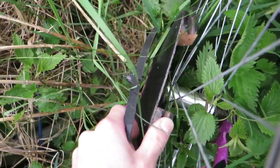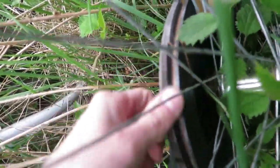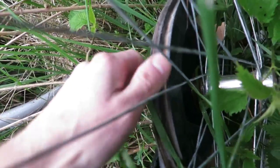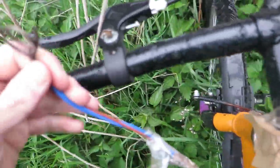Motor shell and the pulley were made of hardwood. This is probably a reason why the motor has burned. Power was supplied by car battery mounted on steering. Through these wires, 20 amps of current were transmitted. There are three 2 mm diameter copper wires.